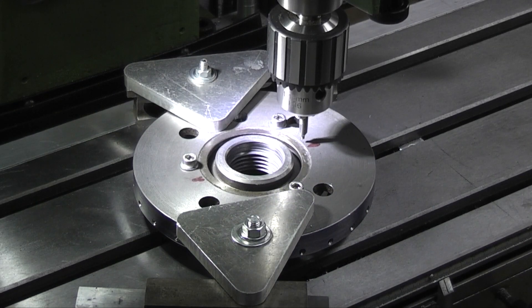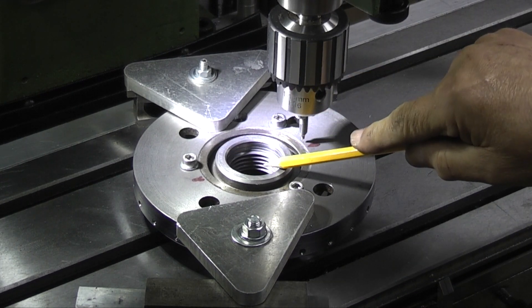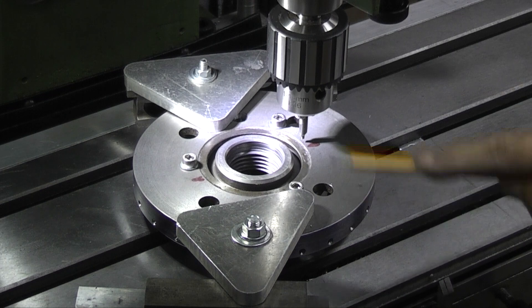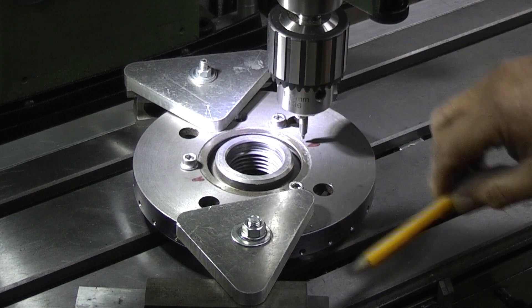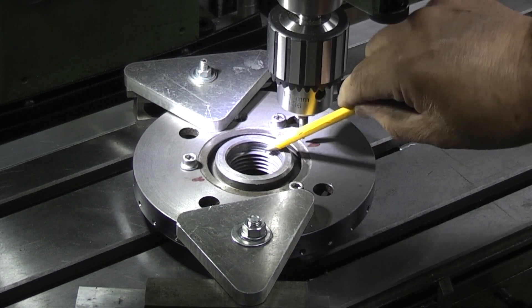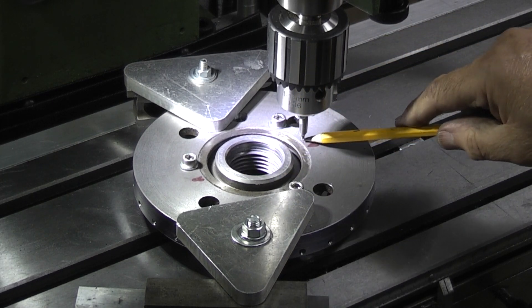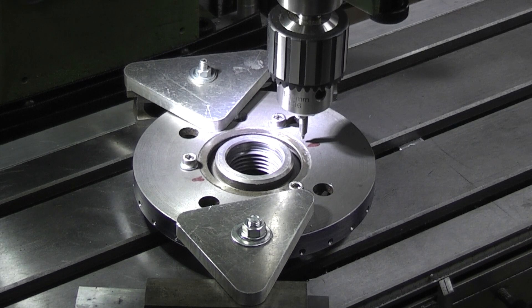In the three holes we drilled earlier, I've put three cap heads and bolted it to the back plate. I then put this back in the lathe and checked the outside was running within reason - that was about three thou, which I thought was okay over eight or nine inches. So now what I've done is put it back on the table, centred on this register in the chuck back plate, and I'm going to drill a hole this side, hole that side, and countersink them for the two screws that will hold the ring to the back of the plate.